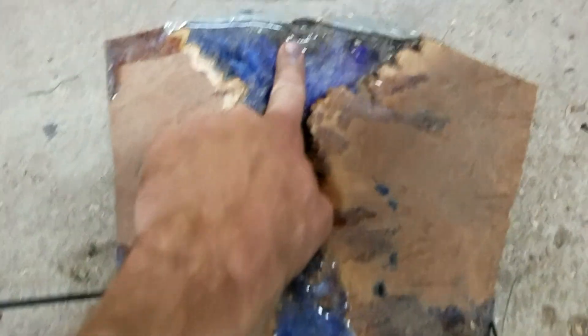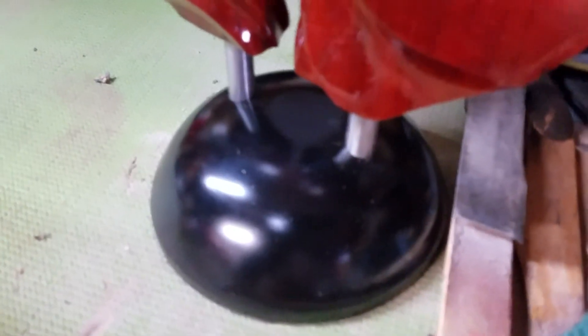Here's what they look like after I cast them. I take the burl, cut it in half, sort of book-match it, lay it down in a plastic bag, and use HVAC tape suspending a banksia seed pod in the middle. Then I use a high-grade epoxy — I can also do it with polyurethane resin if it's small enough to fit in my pressure pot.